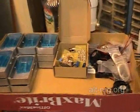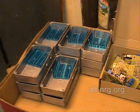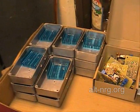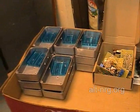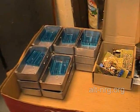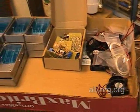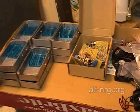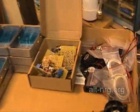And if we come across to this box over here, all of these cases have been drilled. All of the heat sinks have been drilled and tapped. All I have to do now is mount the physical components — the screws, the wing nuts, the printed circuit boards, and the fans — and they will go together rather quickly. I spent the entire evening drilling and tapping all of these enclosures, and of course all of these boards are already fully populated, so they are ready to rock and roll.